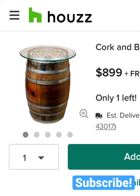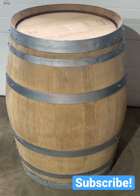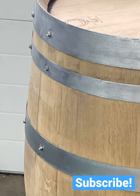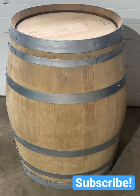I decided to make something like this and I started by washing and sanding the barrels. The wood planks or staves that make up the barrel aren't glued in — they're just held with pressure as they push against the metal hoops. Over time the staves will loosen and the hoops will just start falling down, so you have to add these self-tapping sheet metal screws. I did two rows of them in three different sections.